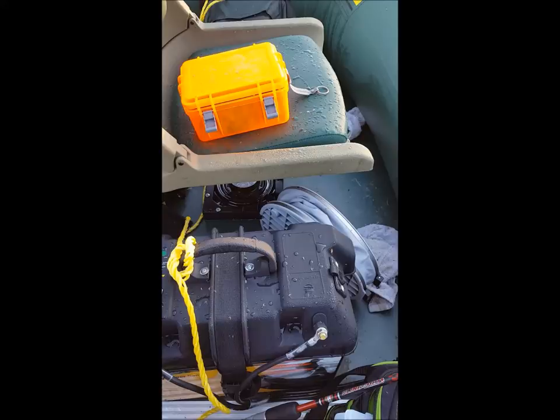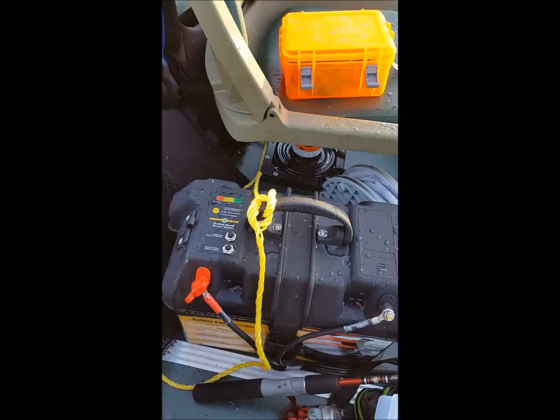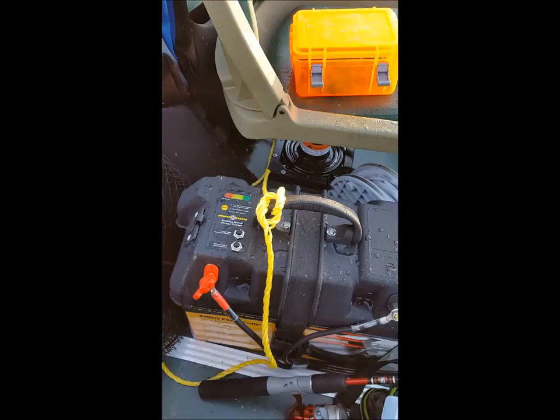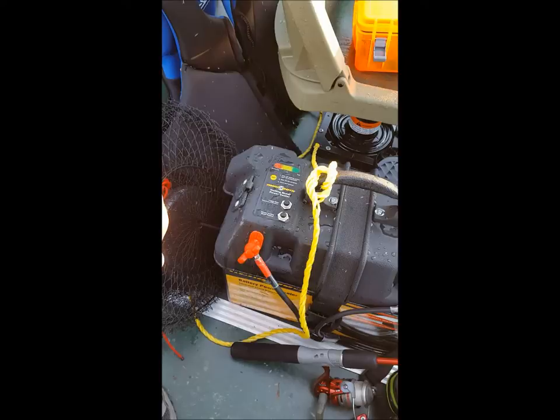On that note, when you're out here for three or four days, these lead-acid batteries do not do well being moderately discharged and then left to sit without charging. On my one or two day camp trips I had pretty much full capabilities out of my batteries, but on this trip I haven't used the boat too much and I've already noticed significant depletion.